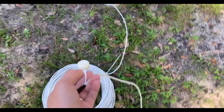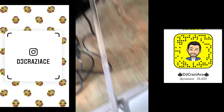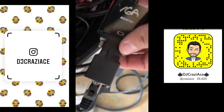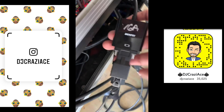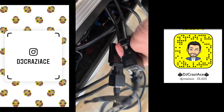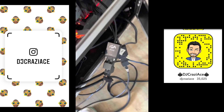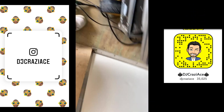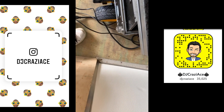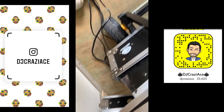Trigger one has been made. I'm running everything through our chaos controller and using a trailer so that, if it rains, I can just shove everything back in quickly. What I did is I added Cat6-to-VGA adapters — they're male Cat6, permanently attached to the tails, and the projectors will also have these permanently attached. So all we have to do is run Cat6 versus VGA cable, without needing a VGA-to-Cat6 adapter. These are passive, not active, so I get maybe a couple hundred feet before any serious signal degradation — but that's more than plenty for me.